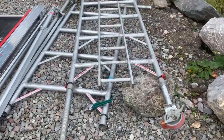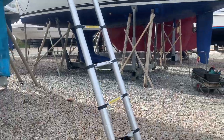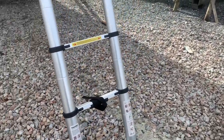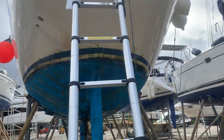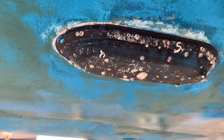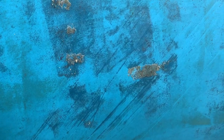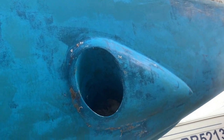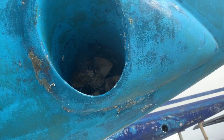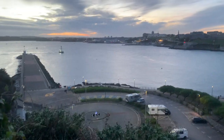We've got a scaffold tower to help with maintenance on the boat. The new collapsible ladder is fitted up and locked so it doesn't collapse — there are quite big steps between the rungs but they're tied off at the top so it can't damage the boat. There are a lot of barnacles on the transducers for the depth sounder and fish finder because you can't put antifoul on them. There's a little growth on the hull where the pads were last winter, some greenery on the boot line, and some on the props — we'll have to take those out and clean them.